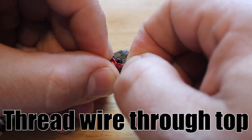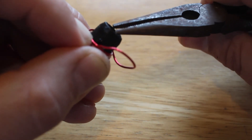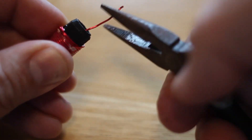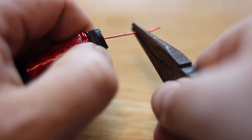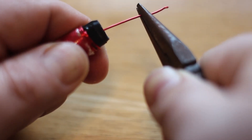Next, we're going to thread that wire through the top. I just bent it into a hook and pushed it through just enough that I could grab it with some needle nose pliers, then yank it through and make sure that coil is super tight. What I don't show is that once I pulled it through, I used a little knife and scraped the enamel insulation off so that it will make good contact with the screw. I'm pulling it to make sure the winding is super tight, then bending it back so the wire doesn't pull back through.